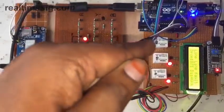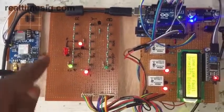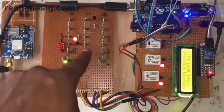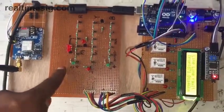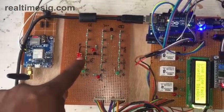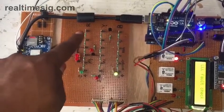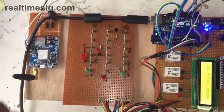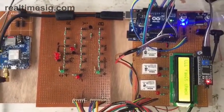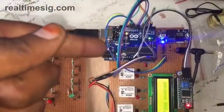These are relays — because we are checking a fault, we do not want to disrupt the electronics that are measuring it. The analog pins of the Arduino are connected from this point, this point, this point, and this point. I give a voltage to this wire and measure the drop across it. The drop will change depending upon the fault happening along the line, and based on the analog values I can determine at what distance the fault occurred. This is the Arduino board used for that.